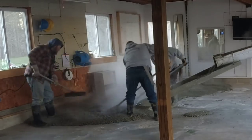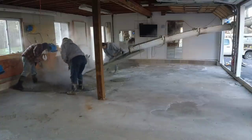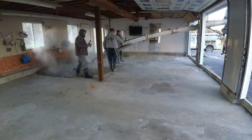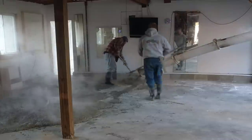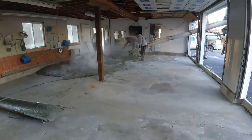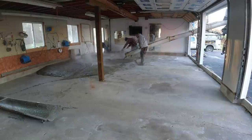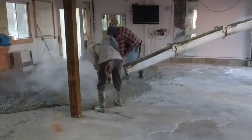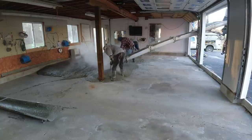The whole front is being redone — those garage doors are coming out, new doors going in. He'll have to bring his driveway up a little bit because we're about four inches higher in the front than the existing asphalt, so he'll have to re-taper his asphalt up to the new garage door. We do a handful of these a year, and in a lot of cases if you've got the headroom, you can pour right over your existing floor — you don't have to break it out. This was a really good candidate because it had a block wall all the way around it, and he was redoing all his doors so door heights didn't really matter.